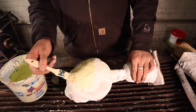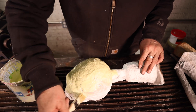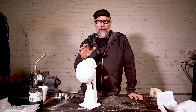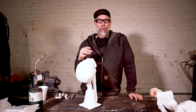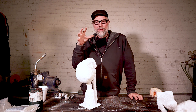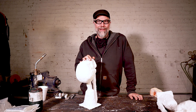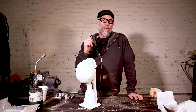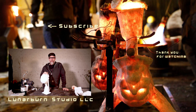Using slurry in combination with fiberglass and coarse stucco is a nice solution for fixing your ceramic shell — definitely for cracking, but you can also fix larger broken shells that way by doing a small section at a time, letting it set up, then doing the next part as you work your way through, depending on how severe the breakage is. That'll do it for the first part of how to fix your shells using just the slurry. In the next video I'm going to talk about mortars and cements. If there are other techniques or approaches I'm missing, let me know in the comments. And as always, until the next video, be creative and be safe.